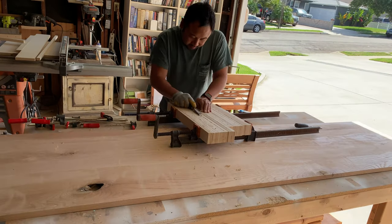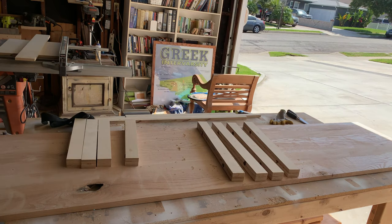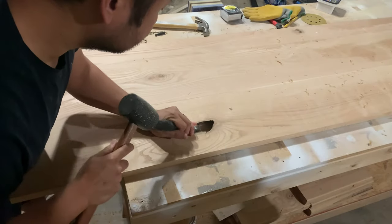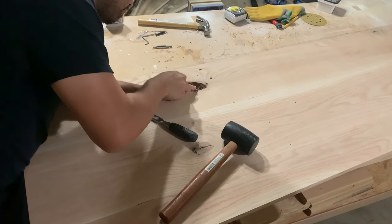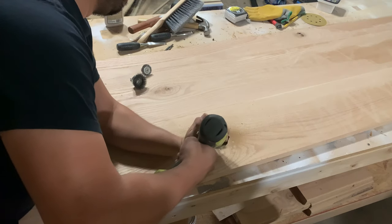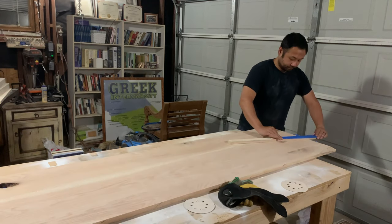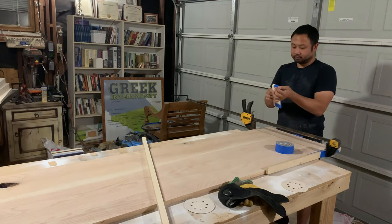Once I was done sanding, I went back to the leg glue-up and got all the dry glue squeeze-out off with a chisel again — some of these needed some convincing. Here are my table legs laid out. Next was to run each piece through the table saw to clean up any glue squeeze-out I might have missed. Now for this project I knew I was going to paint the legs and the base white, so I intentionally picked out a couple of pieces that had cracks and knot holes so I could fill them with white epoxy. Here I am cleaning out a knot hole with a wire brush and a chisel. Then I took some painters tape on the bottom side of the table and covered up all the holes and cracks so the epoxy wouldn't come through the other side. Then I flipped the table over — the top left corner dipped down about a quarter inch — so I made a little corner mold for the epoxy pour.